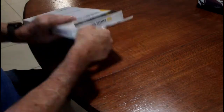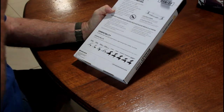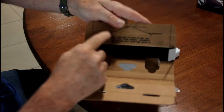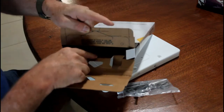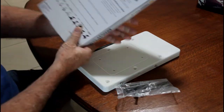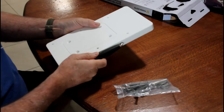Before we get too far ahead of ourselves fitting the motor, we'd best start by unboxing these things. This quick release fitting suits a range of the Minn Kota motors, but there's also more than one quick release, so make sure you pick up the one that suits the motor you have. While we're on the subject of packaging — there is some writing on the inside of the packaging: do not tear your packaging. There's a template drawn on the inside of the box that you can use for drilling your holes in the boat to mount the motor. Unfortunately there's no big red writing on the outside warning you of this, so here's your warning: do not damage the box, cut the corner open, and you've got a template for drilling your holes into your boat.